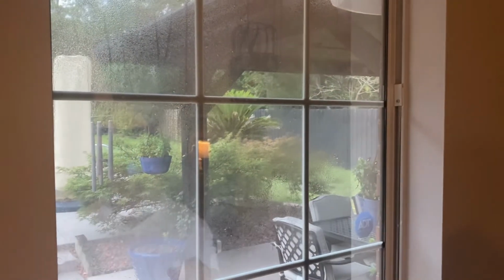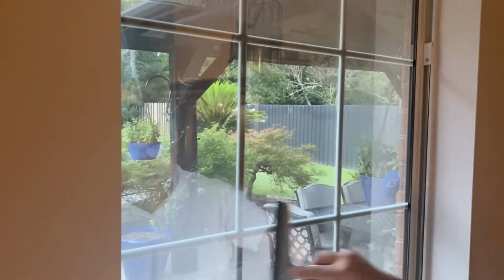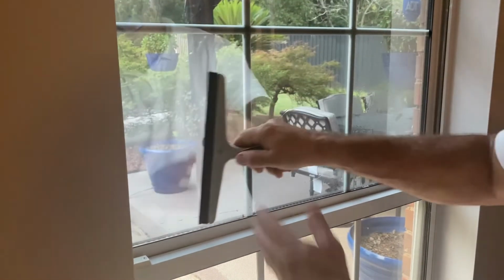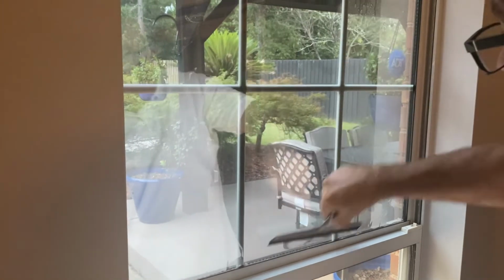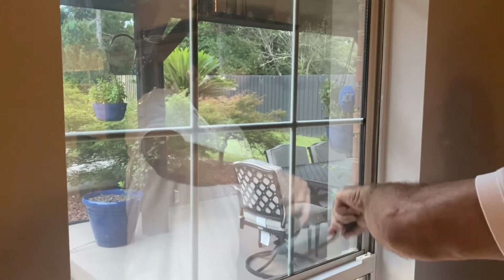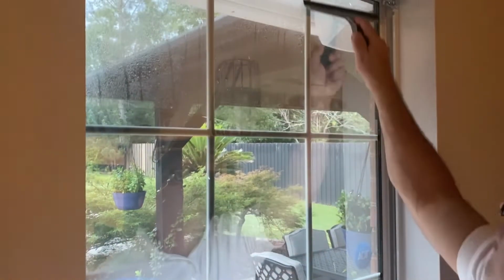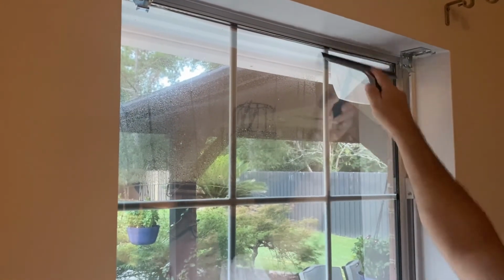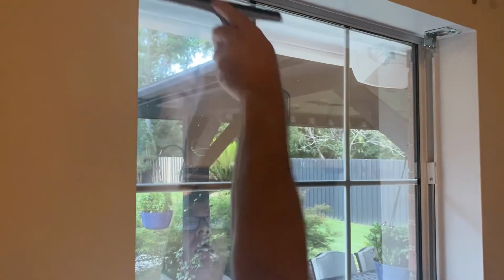I will now be more aggressive pressing out the film, working from the center to the sides, ensuring that it doesn't slide out of position. This aggressive pressure removes the trapped water between the film and the glass, so the adhesive can start curing. I will continue this process until I feel that I remove all the air bubbles and have a smooth layer of film, continually spraying the surface for lubricating the squeegee.